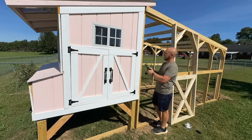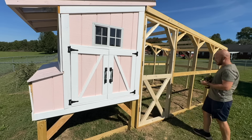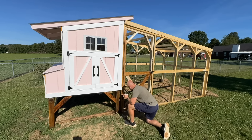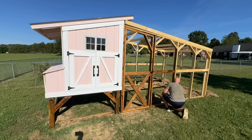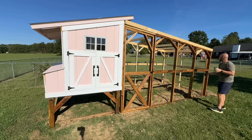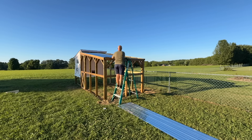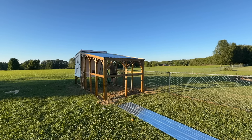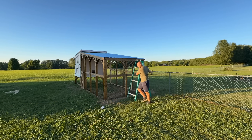Next up I installed the door, which was a little more complicated but I did get it to work — it uses just regular door hinges. Before putting on the hardware cloth and roof, I went ahead and stained all of the run parts and the bottom posts of the coop with Minwax Early American Stain, which I think is a great contrast with the pink and white trim. I just wiped the stain on with a t-shirt rag and needed a ladder for the high parts. After letting that dry, I installed the metal corrugated roofing using the same process as the main coop house — overlapping pieces and as many screws as possible to withstand wind here in Middle Tennessee.